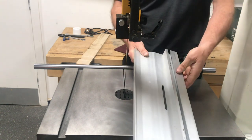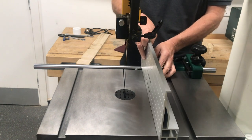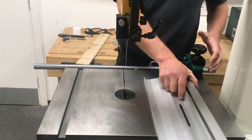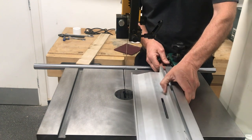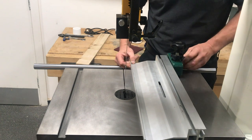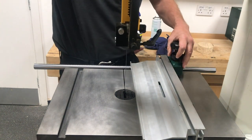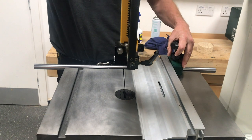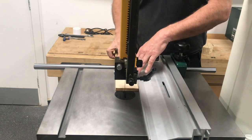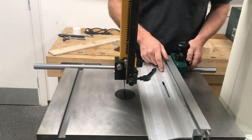On the backside you can see some wear pads — those are what run on the rail and stop metal-to-metal contact. Over time they can need replacing, but we can turn the fence over and run it with the high side down to the table, then go through the same procedure making sure it's lined up and square, locking off on the cam. When we bring the guides down, you're still going to get the support needed when you're doing thinner pieces of timber.